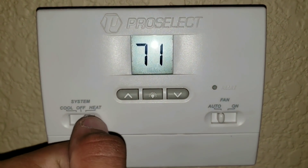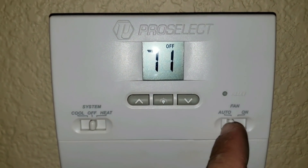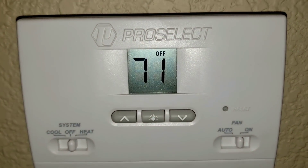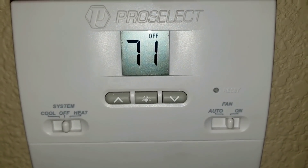I'm going to set it to the off position and now I'm going to see if I can turn my fan on. I've been waiting for a couple of minutes. My fan hasn't turned on, so most likely I'm going to have a problem with the furnace board.